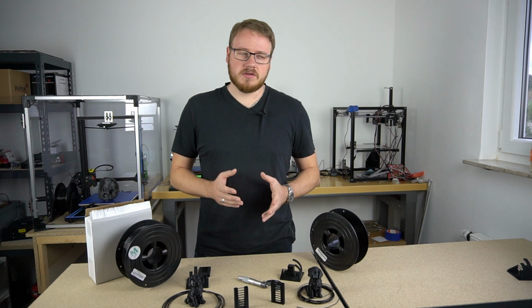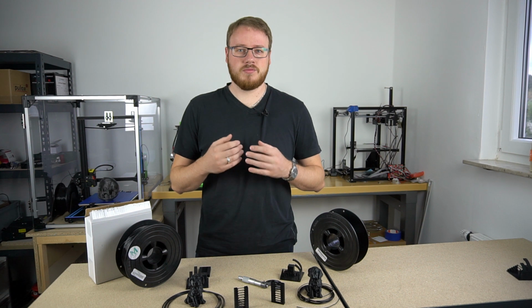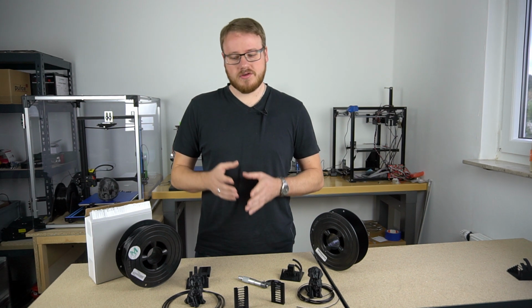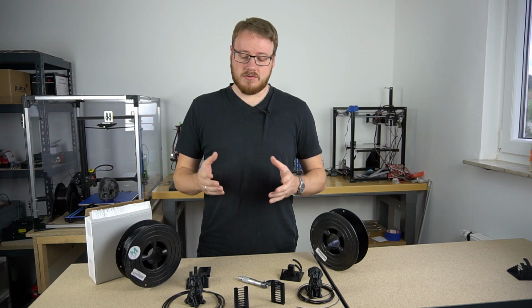The funny thing, or better the sad thing, is that printing with the A quality filament was not as easy. I had huge issues printing the A quality filament. I even got no good print in the beginning. During printing, I could hear the popping sound of the moisture in the filament. So, see here the results of the first prints.